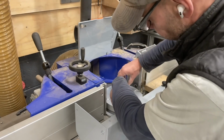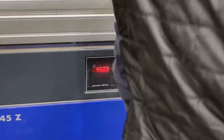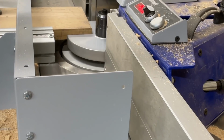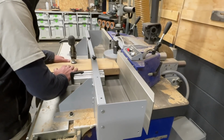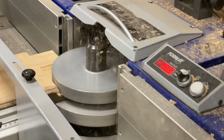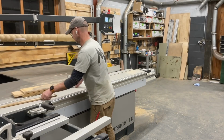Obviously we've heard it all before. These doors were for a different workshop, different opening. I wanted to reuse it and I came up with a new idea. So the bottom rails, the styles, the verticals, we've got them now. You've seen that made. The bottom rails are only going to have a single side to the tenon. It won't be stepped. And then you're going to see later on in the video, although I've lost some footage, how I do a resin panel on the back and a tongue and groove on the front. So finally doing the rebates on the rails for the glazing units and for the T&G at the bottom.